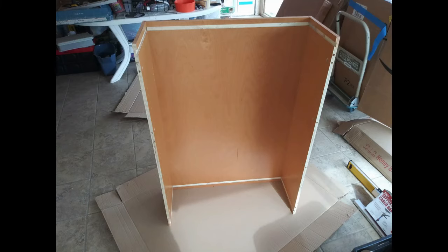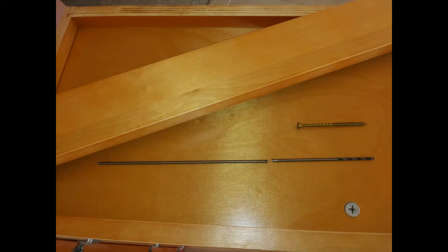The new cabinets were fairly easy to assemble, kind of like IKEA furniture. I debated using glue on the joints as well, but eventually decided not to due to the cure time and having to keep cleaning up drips and runs — it seemed solid enough once assembled. I didn't have an appropriate length 1/8-inch drill bit for the pilot holes needed when attaching the 3-inch wide spacer boards to the cabinet front panels. Home Depot only had a really long one, so I measured and cut it with a cutoff blade in a handheld grinder to the perfect length and cleaned it up with a flap disc. Worked great.